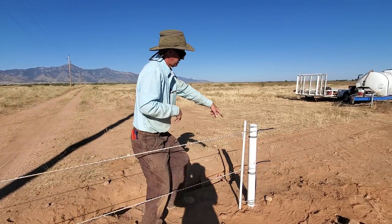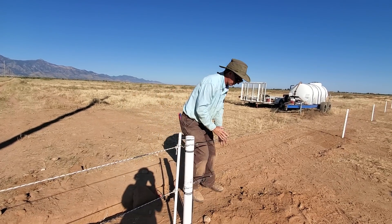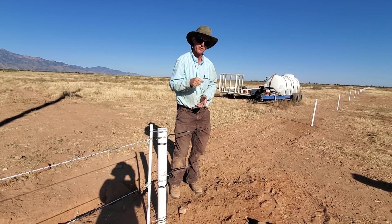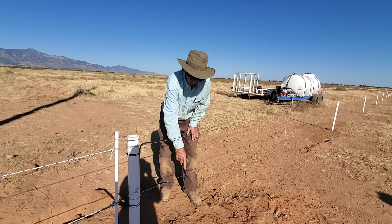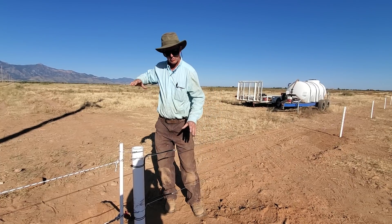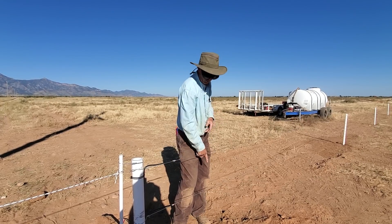The reason we ran a ground wire is that it's going to be run all the way around this farm and back to the charger. It's dry out here — when an animal tries to go through here, if their hooves are real dry and they haven't had rain for a long time, they're not grounded, so they can hit that wire with 8,000 volts and not feel it. But when they touch the ground wire, it connects back to nine ground rods, six feet long. When the animal touches the hot wire and the ground wire at the same time, it's like they're standing on that ground field — they're going to feel all of it.